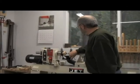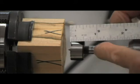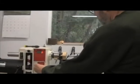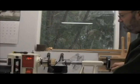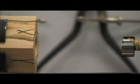I've used this bit for the same thing many times, so I already have a mark on there from where the bit makes its cut up to my mark is 7/8 inch, and that's as deep as we want to go. The speed is still set, so all we have to do is turn the lathe on, and then the same process, start cranking it in until it starts to cut. That's it right there. Pull that out of there, and we're ready to go for the next step.